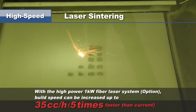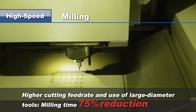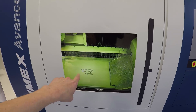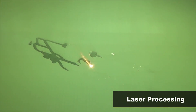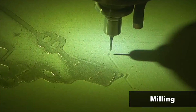They're doing a sintering technique where they're printing, say, 10 layers. Each layer is half a millimeter, and then they're going to come in and machine it back down. What's really cool about this is that you're able to sinter with a laser, but the machine tool can stay basically ready to go. As soon as a layer has been sintered, it can come over and do the machining that needs to happen, and then hop right back.